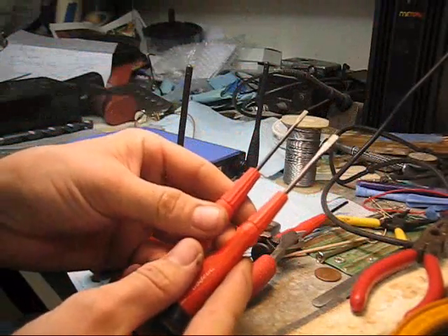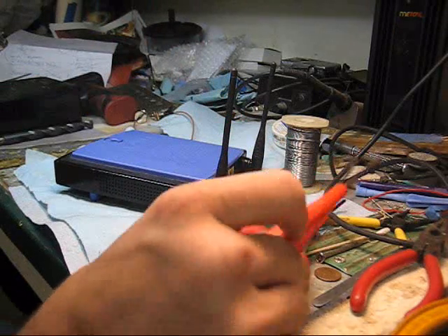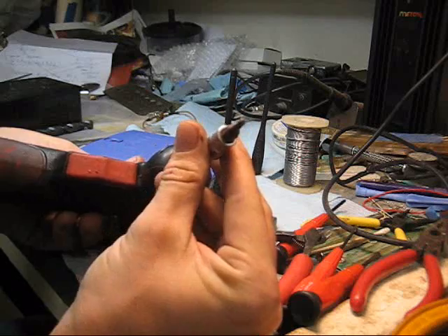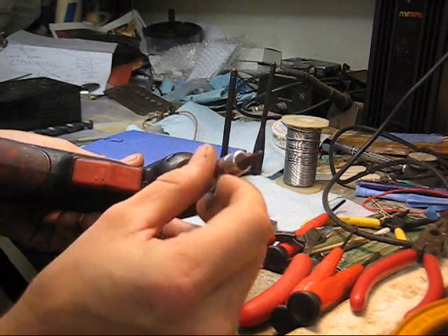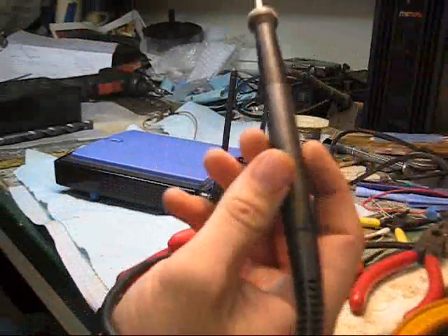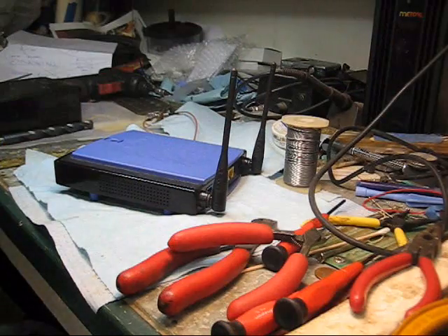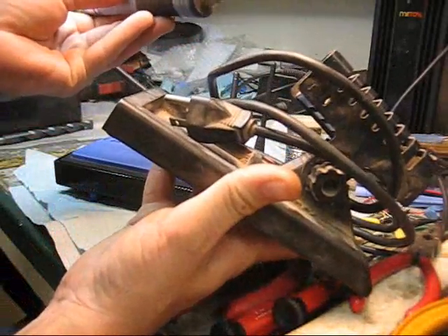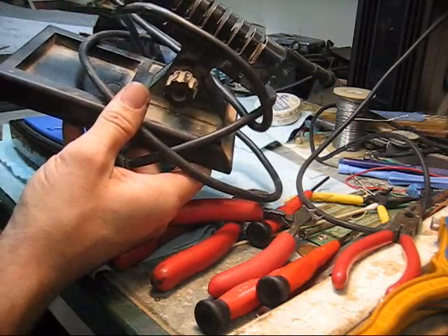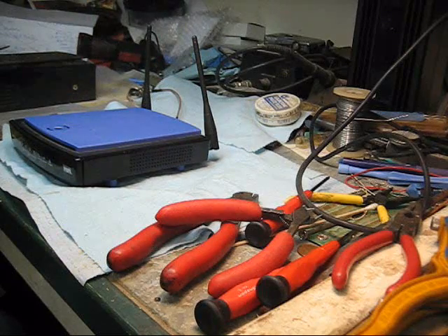You're definitely going to need a couple of small screwdrivers in different sizes. This unit is a snap-together design, so you're going to have to get in there — I'll show you how to do that. Once you get it apart, you're going to need a Torx bit; this is a hollow Torx that accepts the new style. Also, I want to talk about your soldering station. If you're a homeowner and you don't have a really good solder station, I recommend trying to get something similar to this basic unit. It can handle just about any work on a motherboard or regular board without making the circuits too hot where they connect.